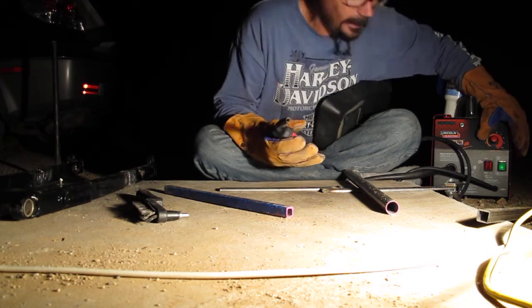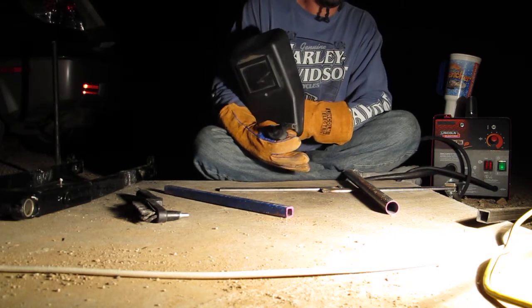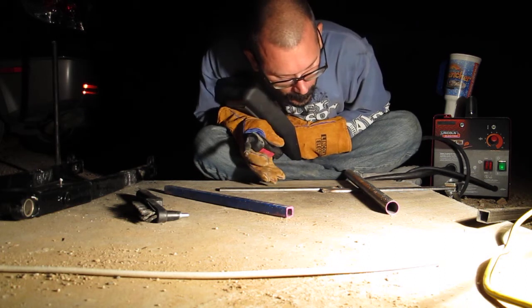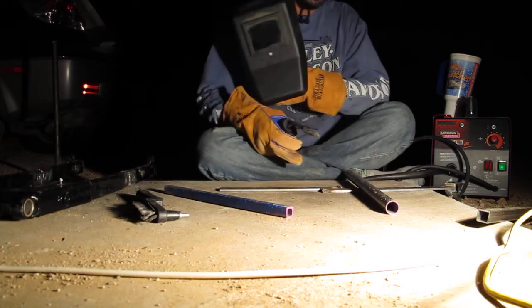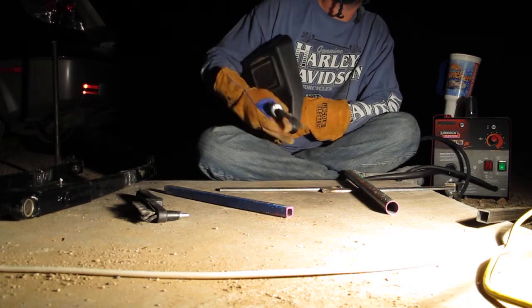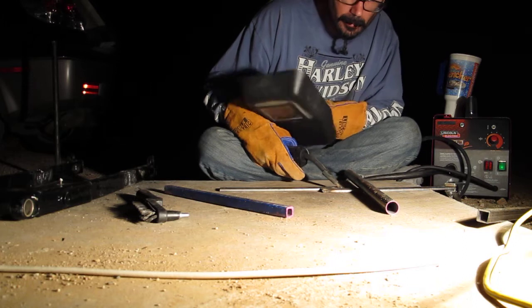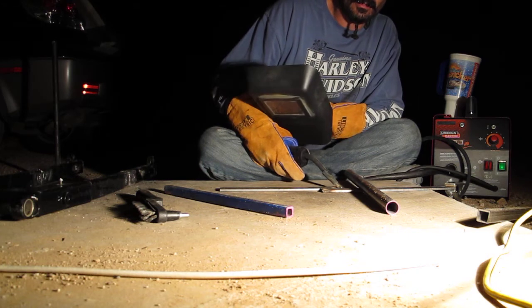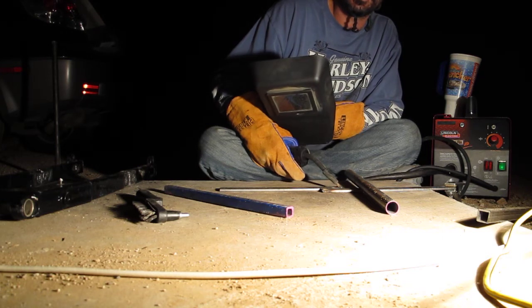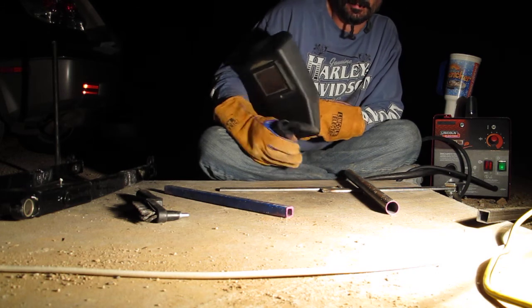Let's slow the wire speed down to eight — I think that might help. I think the power needs to be all the way up on this bad boy because I'm working on probably eighth inch metal, which is the max this welder is supposed to handle. Get your tip close, get your shield in place, and as you start it up you might stop and start, it might pop, you might pull it away, it might stick — just go with it and establish a bead. You're not building a space shuttle, you're just trying to weld a couple pieces of metal together.